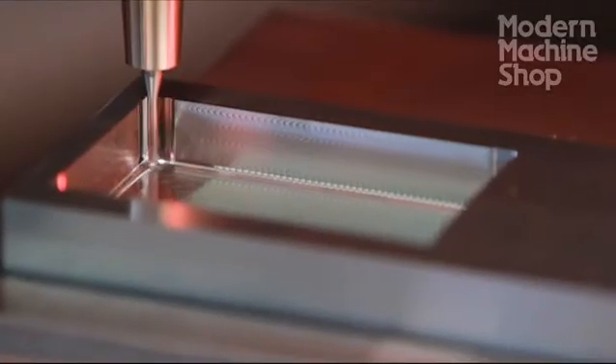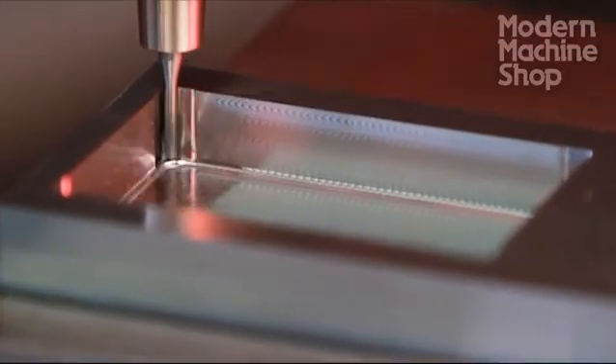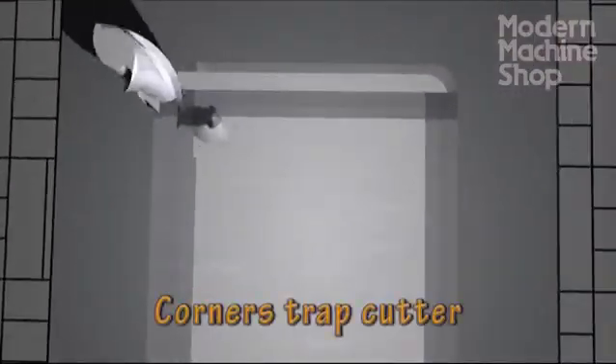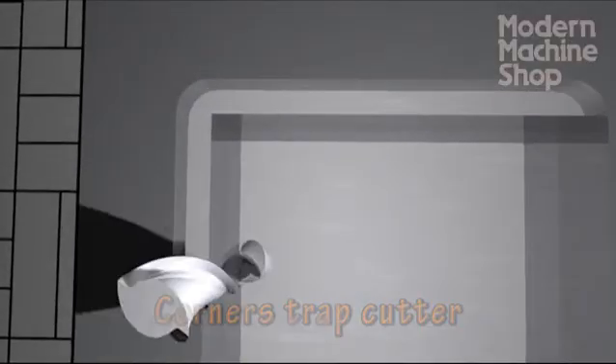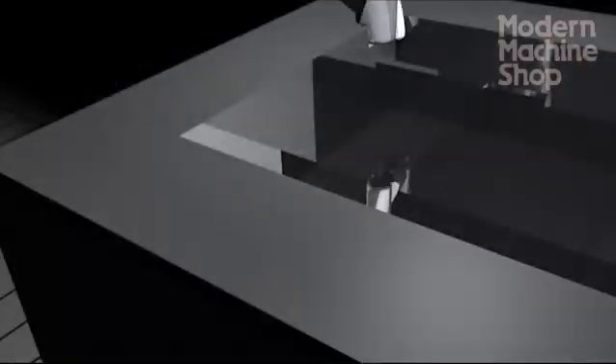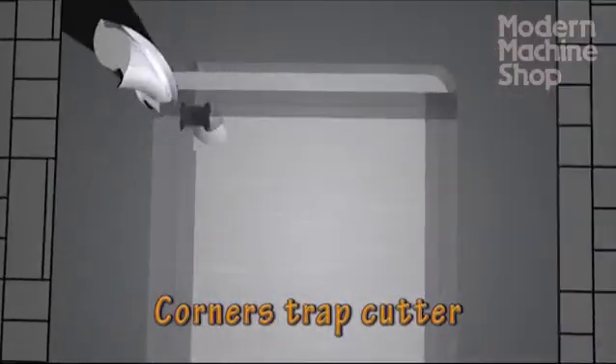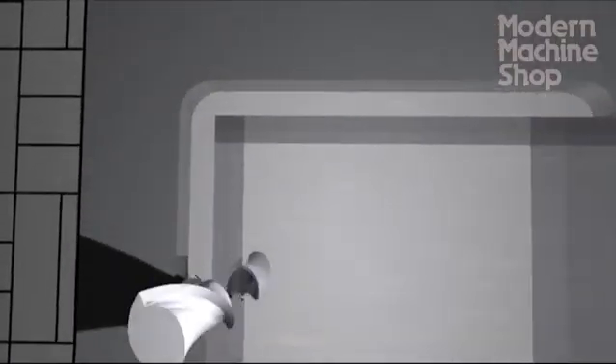Special techniques can produce smaller and accurate corners too. Milling into an XY corner increases cutter contact to 90-degree engagement or more. Simply using relieved end mills does not overcome this problem, so we need to take special care in the corners.